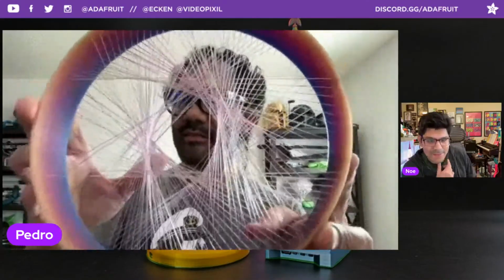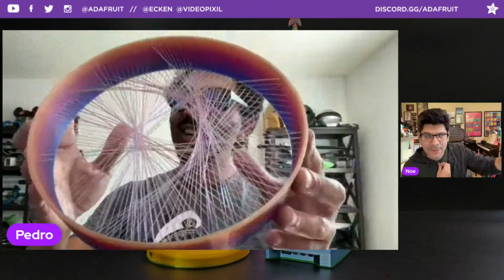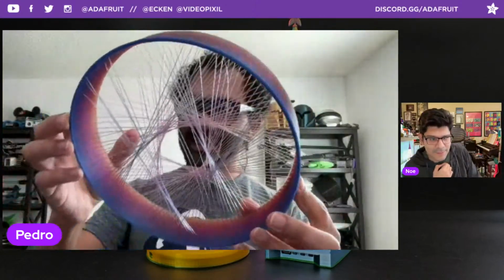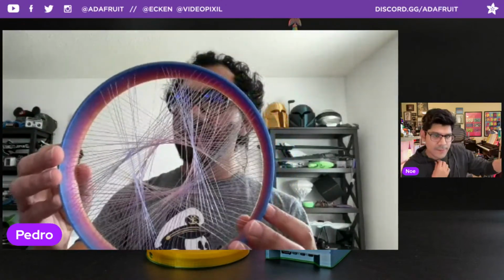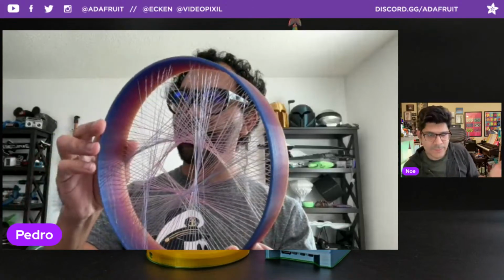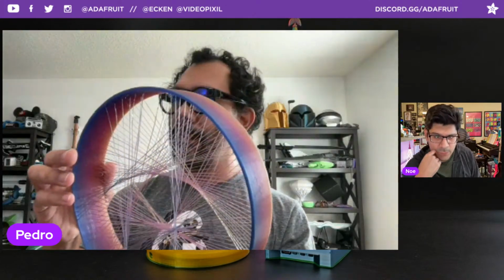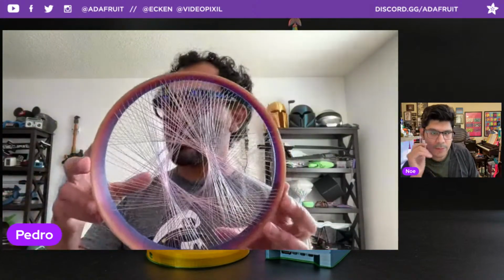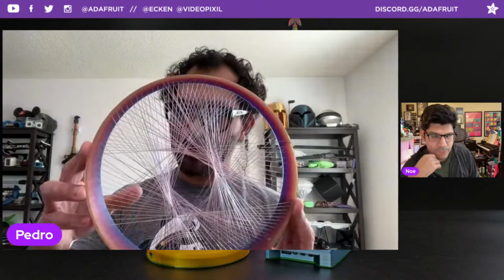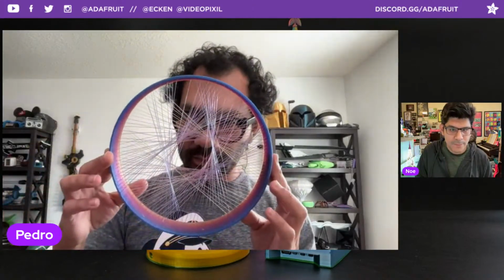DJ Devin says, wow, that is some crazy bridging. Yeah, look how giant it is. It's amazing that you can get one line going across. It is delicate, but it's a bit of an art. So when you sliced it, it just knows to use one string? I'm guessing the size of it is just small enough that the geometry doesn't get picked up. Probably your nozzle is 0.4. Yeah, no support material, obviously.